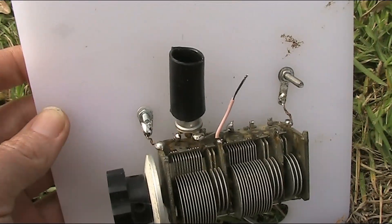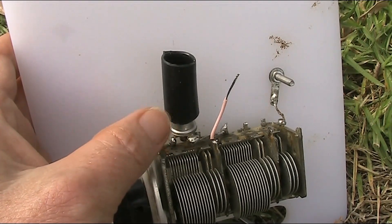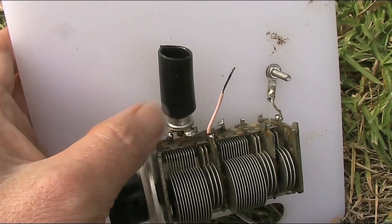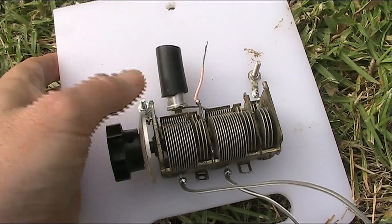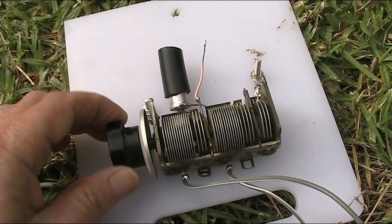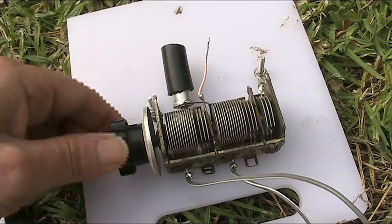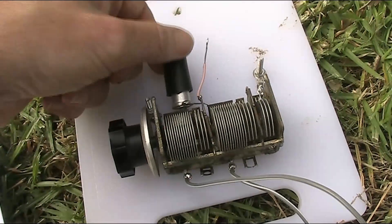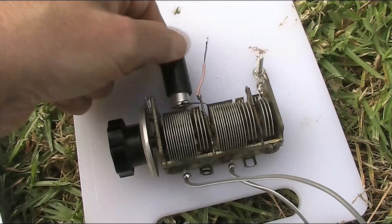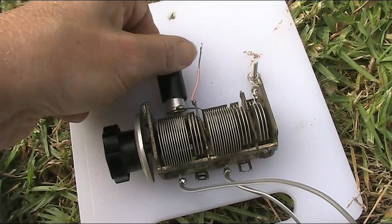And again, this is an option. I've got a trimmer capacitor across — it only goes up to about 25 picofarad — but that provides some finer adjustment, which could be useful for a loop where the adjustment is normally very fine, especially as I'm not using a reduction drive on the main capacitor. So I'll do the main adjustment on here, and then the fine adjustment just by adjusting this beehive trimmer. The multiple turns means that it provides finer tuning without a reduction drive.